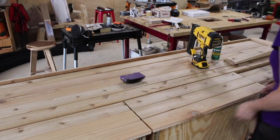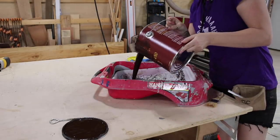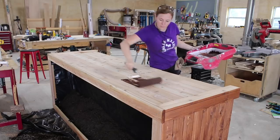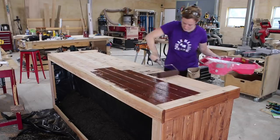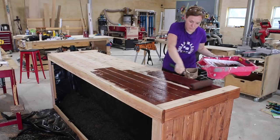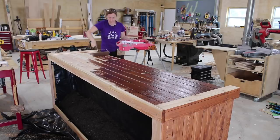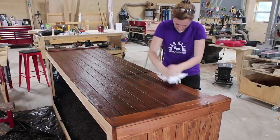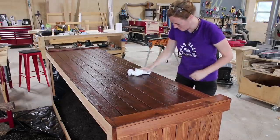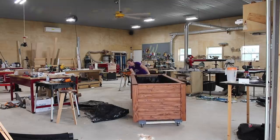Now it's really just the finishing touches — let's put some color and protection on it. I've had a great experience with General Finishes 450 Outdoor Stain, so that's what I went with here. It's specially designed with an exterior-rated pigment for durability and a resin system that provides great adhesion. It dries in just an hour or two and doesn't require a protective top coat. I used a roller to apply the 450 in the cedar color, a paper towel to wipe off the excess, and then a dolly to move the big box outside where it will live.